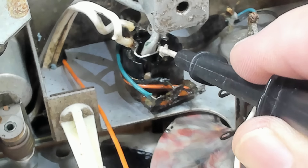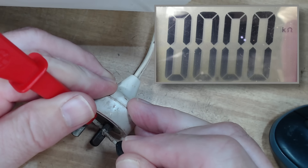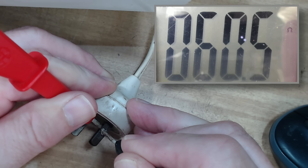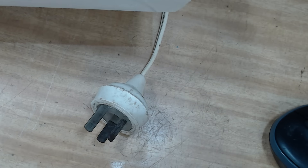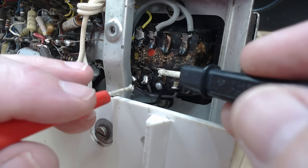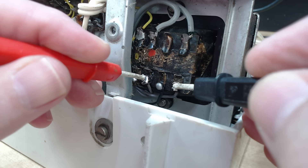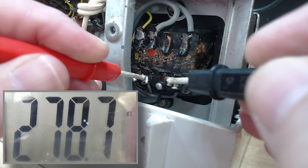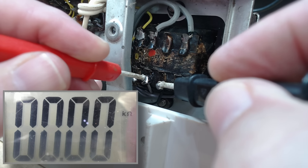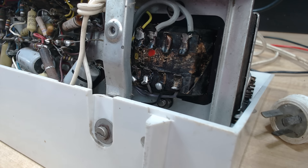I've soldered across the switch contacts - I think this is the one that was playing up. With the meter it should read 60 ohms. There it is, so we're connected now. Here's the grey leads from the power supply coming in - those are the primary. There's a black wire, a purple and a purple here, so these will be the secondary. That's reading 278, that's 134, and the other one is 144, so that's checking out okay. I'll put some power on and see what happens.